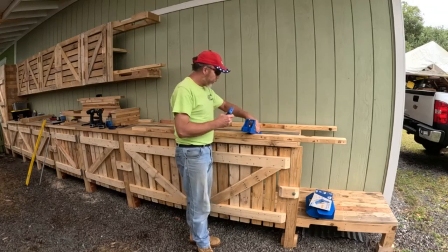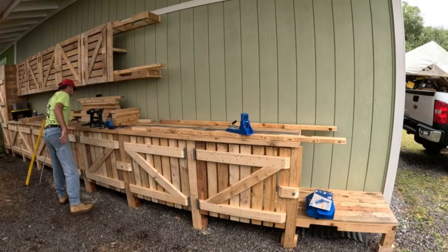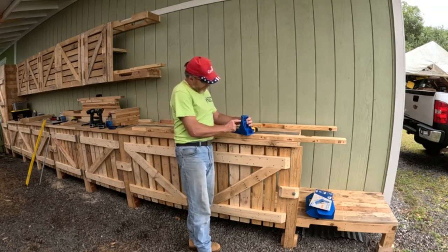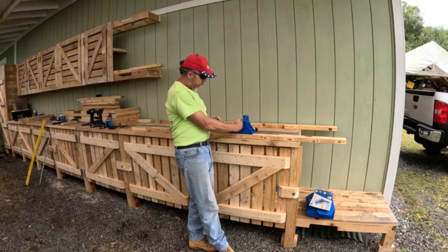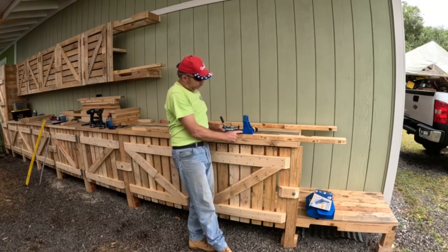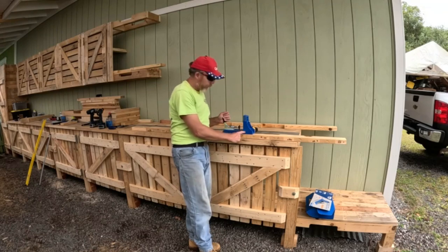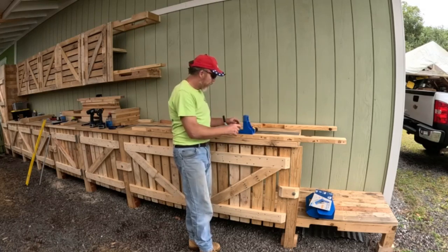The guide block has numbers on the side. When you slide your wood in, you take the measurement of the width — inch and three eighths on ours — and you drop it to that line. It's got a little screw with holes that locks it to the depth, and it clamps down on the wood to hold it in place when you drill. Now, this 90-degree framing piece — don't over-tighten it when you tension the clamp because it has a tendency to snap right there. It's plastic, so watch that — not just this one, any of them.